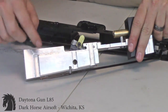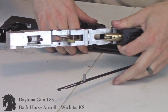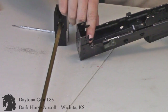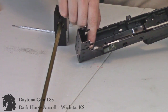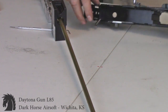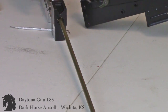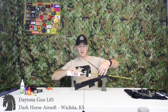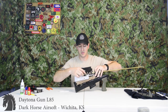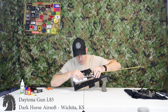The area is right here again. So we're going to put that bar inside of there. I'm probably going to have to get away from a close-up here for a second. But now we're going to put this back in. There's this little spring here on the outside. Make sure that's hooked on this little back piece here. That's what you're going to need it to be, okay? It's going to end up attaching itself to this arm here on the actual lever right here. So what I recommend is taking this. You're going to put that little silver guide rod, that's here on the bar, inside this piece. Like I said, it actuates the bar. So you're going to push it in.